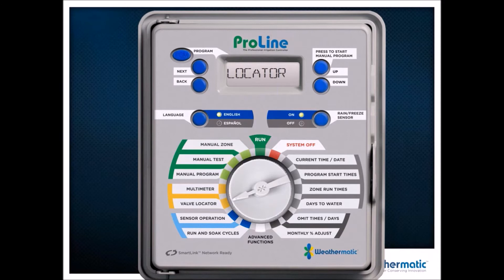Valve locator — we chatter the valve, but you need to shut the water pressure off in order to do that. When you shut that water pressure off it allows that solenoid to chatter. Now if you have a broken wire, that's not going to work, so a lot of times what I do is take my 521 and chatter a nearby zone — like if zone 5 has a broken wire, I'll chatter zone 3 to get me close, then put the 521 out in the field. That gets me closer to the zone because systems are generally laid out in order, so zone 3 won't be too far from zone 5. If I hook my 521 up in the field I get less wire congestion so the signal is stronger and I can trace that wire and find zone 5. A lot of guys keep controllers on their trucks just for the diagnostic — it's a big deal.